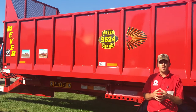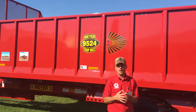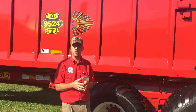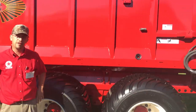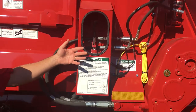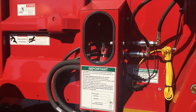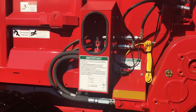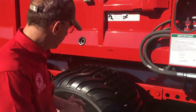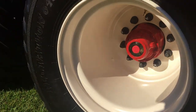They feature a variable speed triple apron system with steel sides and a solid polyurethane floor. They feature a reversing feature on the apron, so if you overload the beater for any reason, or if you get a foreign object in the system, you're able to reverse that apron and free the load. These units are available in truck or trailer mount. This particular unit today is equipped with a 3,000 series tandem trailer with suspended axles, with oil bath hubs, and with the 740 22.5 tires.